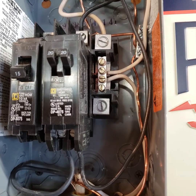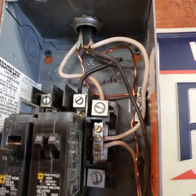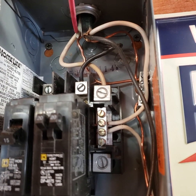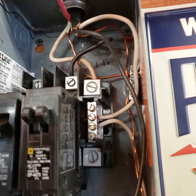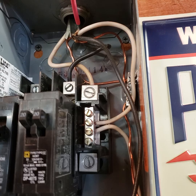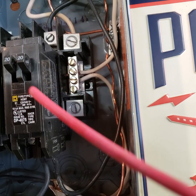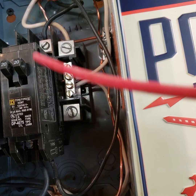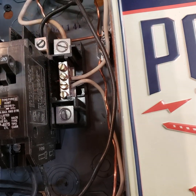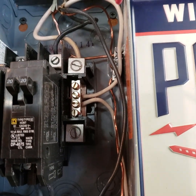This is a little breaker box I put in the garage. This gray wire is the feeder — that's a 10-gauge wire but it's on a 20-amp breaker out of the house. That goes to a light and that's to an outlet, so that's one breaker for this one circuit for the light and the outlet. 220 is not used there.